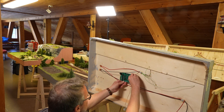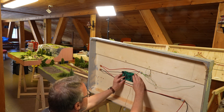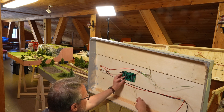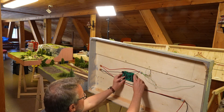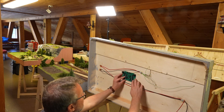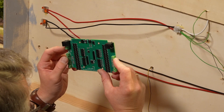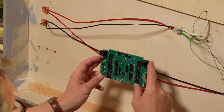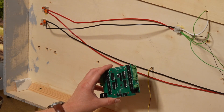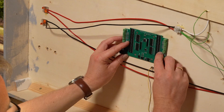We find a place for the module. It makes more sense to orient it this way. One cable goes to the light in the station, so it's not supposed to go to this module. The module has a power plug on one side — on the left side, this needs to go to the power, so turn it around accordingly. Now you need to screw it in place.